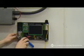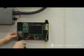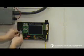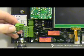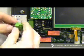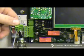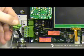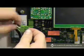You should strip the wire back to expose approximately 1 eighth to 1 quarter of an inch of copper. With the terminal block removed, insert the line voltage leg into the top terminal, the neutral leg into the middle terminal, and the ground into the bottom terminal. Make sure that no bare wires are exposed — a good tug on the wires will ensure a good connection.